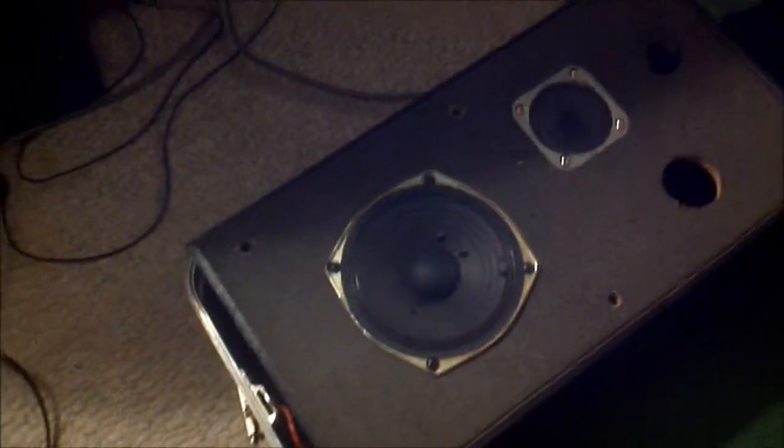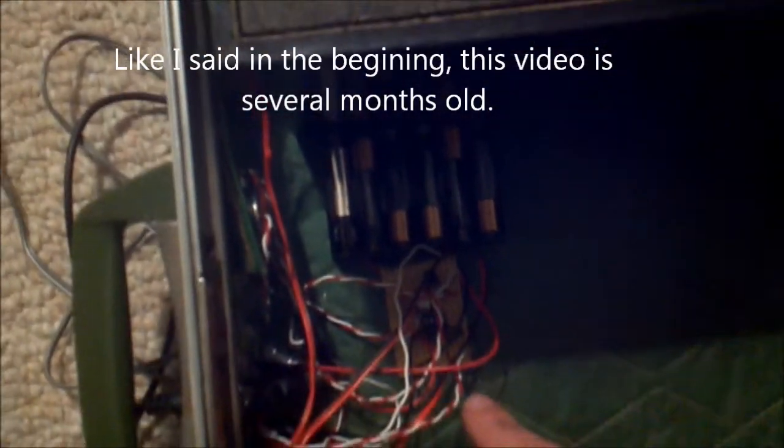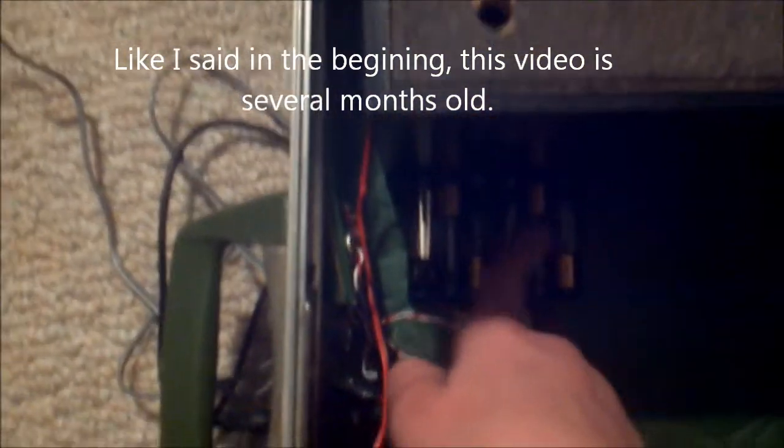I took the speakers and mounted them on the inside, and drilled holes to let the sound escape better. These are screens from the outside of the speakers — I put them on to cover up the holes, because I had to cut the interior liner with an X-Acto knife to get the sound to come out better. I just took a couple of wood screws, drilled some pilot holes, and got them in there. There's a circuit — it's the LM386 amp that I built in my last Basic Electronics episode. Here's the batteries, and the interface I just showed you is on the other side.